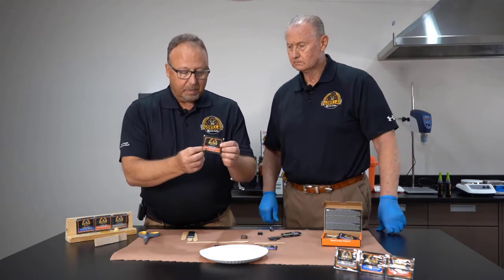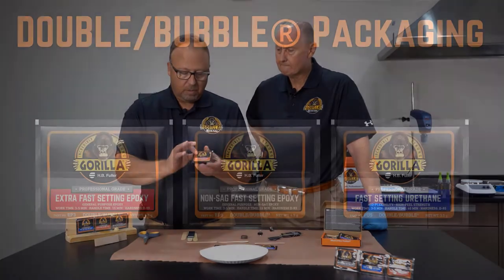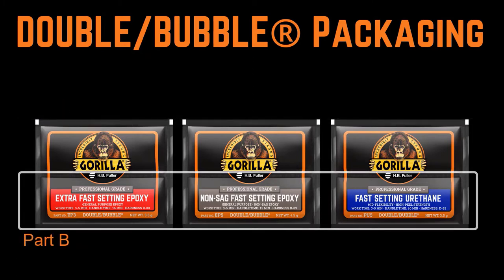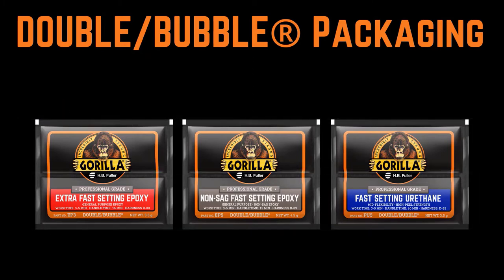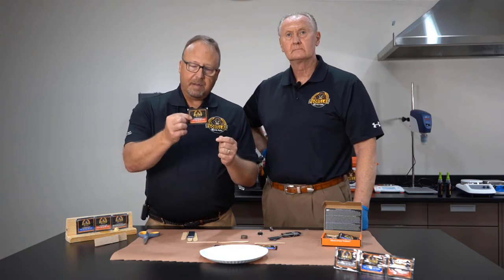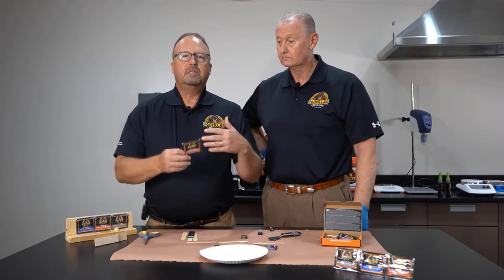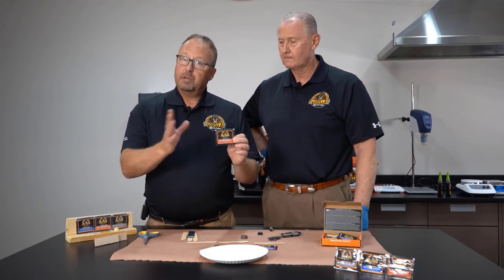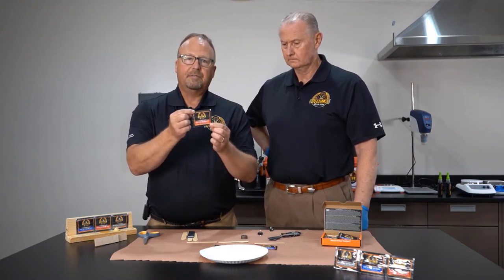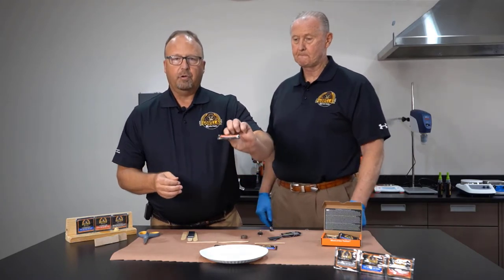These come in what's called a double bubble pouch system. There is a Part A and a Part B inside, separated by a seam. Instead of a 50 or 250 milliliter cartridge with a gun and nozzle, this is ready to go. It's a single-use application — 3.5 to 4.5 grams, which is typically enough, and there's no waste. To use the EP3 fast-setting three-minute epoxy, you simply fold the packet over, push the product down a little bit, cut it off with a knife or scissors, then flip it up and pull it out.